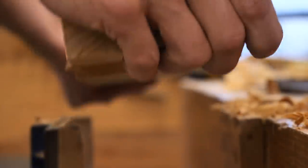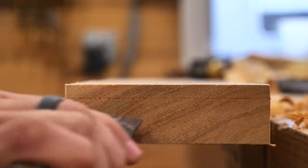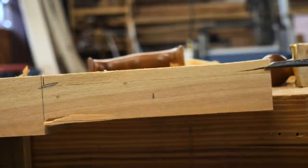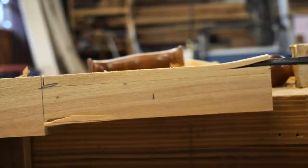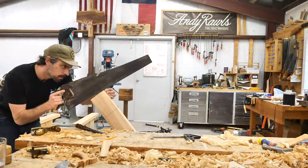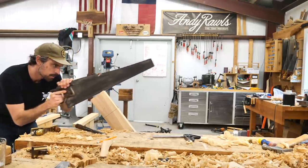I'm going to flip the board over and basically try to do the exact same technique on this side, but as I mentioned earlier you're going to see that this isn't going to cooperate — it's actually going to split down into the tenon, which basically means that we can't use this technique, it just won't work. I move it up here, try to take less material, but I'm going to get a little bit further down here and it's just going to start to drift down. So I have to opt to use a handsaw, which is just as effective. This is a great part about this video — you're seeing a couple different techniques on how to hand cut tenons.